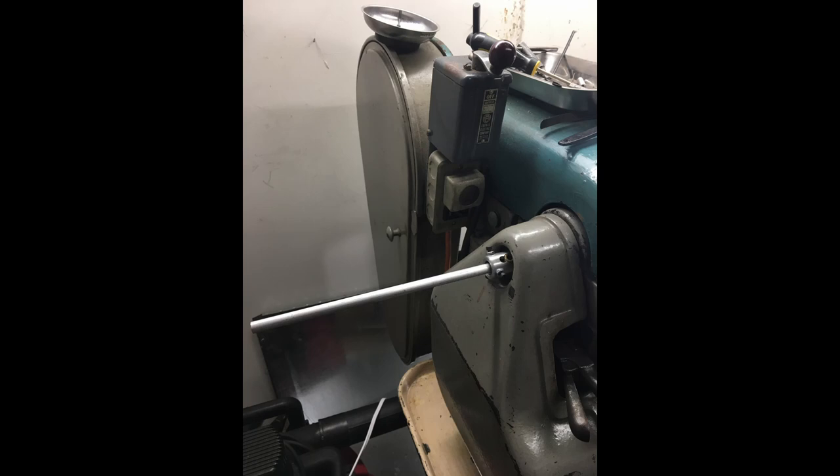Most projects in this little shop of mine, one project requires another project. One of the problems I was having is when I put these three-foot pieces of 5/16th aluminum rod in my lathe, it would tend to whip on the feed side of the spindle.